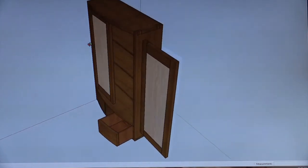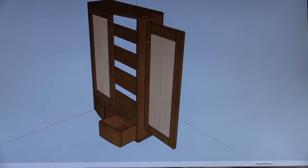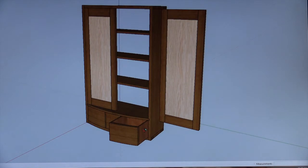The base, the top of the drawer cabinet, and the top of the overall cabinet will all incorporate that exact same curve. And you can also see that the case itself is going to be dovetailed together. So this is incorporating the dovetails, the case construction, the cabinet, the drawers, as well as the curvature — elements that are really going to help me fine-tune those skills before I move on to the more complex sideboard project.